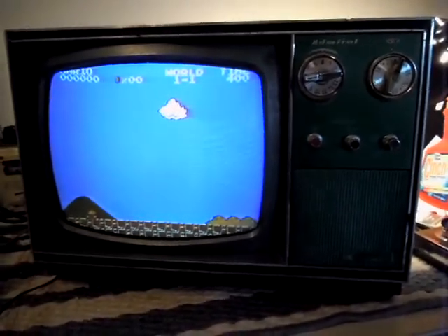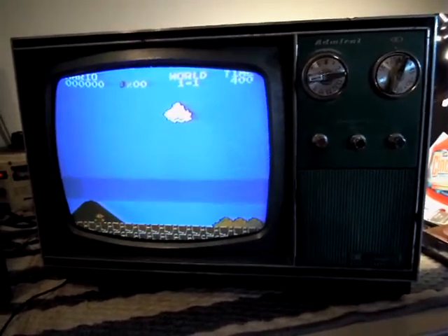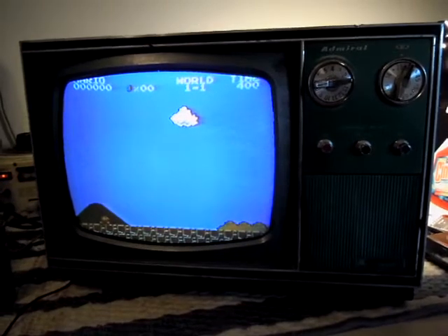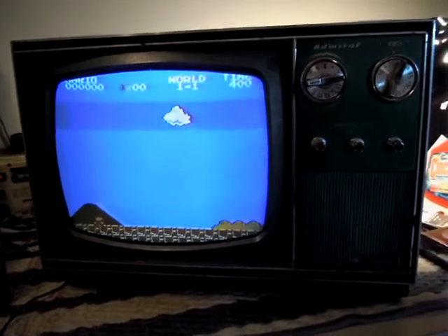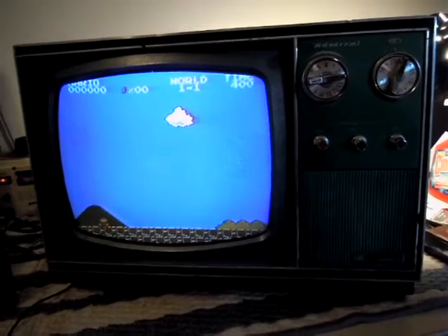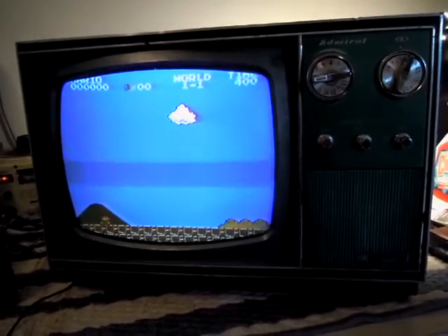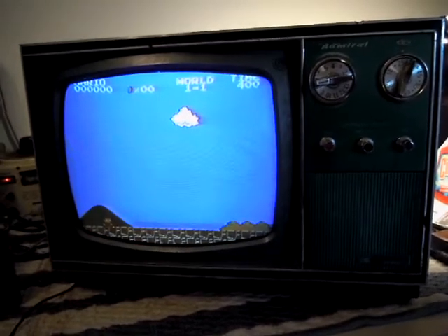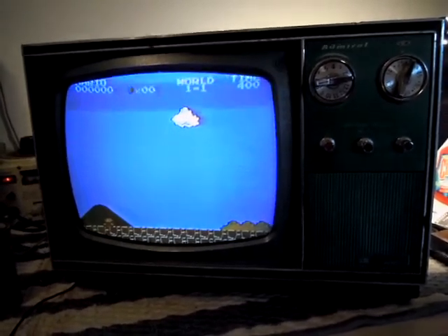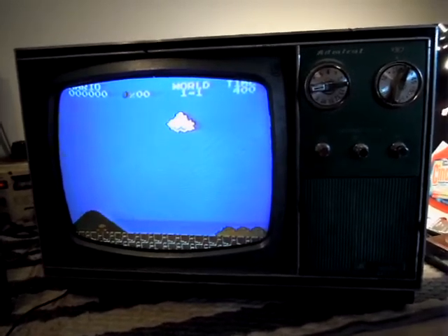So that, in combination with miswiring of the control grids on the CRT — the voltage on the CRT grids was too high, around 190-something, when it was supposed to be about 170 — was just due to a wiring error on somebody's part. Somebody omitted and shorted across the grid resistors, which I don't know what they were trying to do there, but that was really stupid.